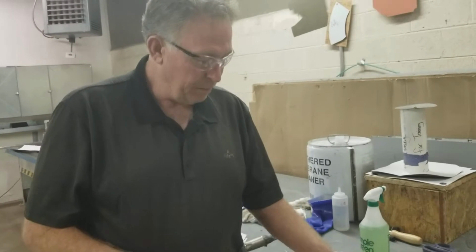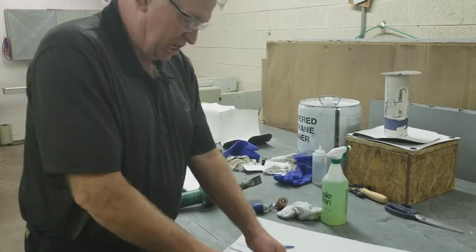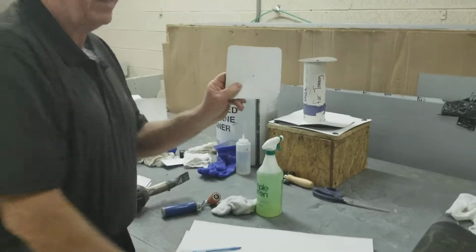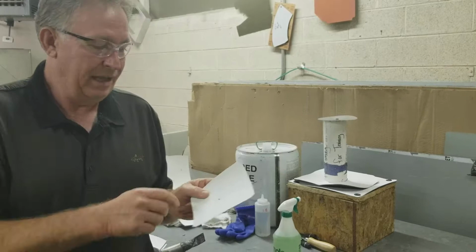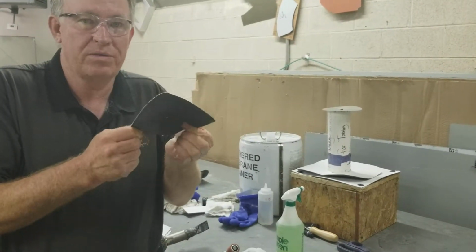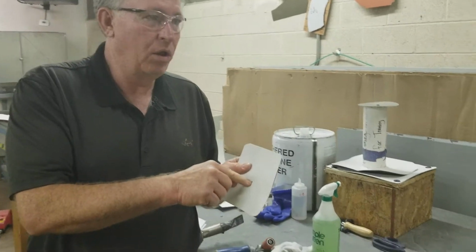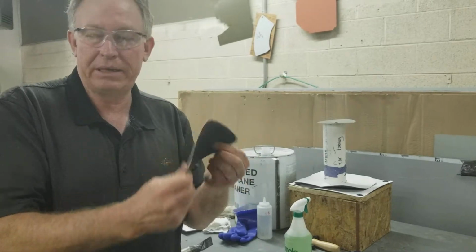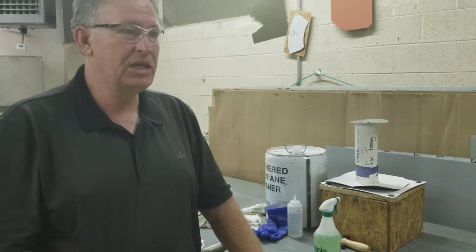But you can't, if this sheet has a hole in it, right? I can't patch that with unsupported membrane because it's unsupported membrane. It's an inferior sheet to the supported membrane sheet. So I can't patch this hole with an inferior product. It's got to be a supported membrane. But I can patch T-joints.